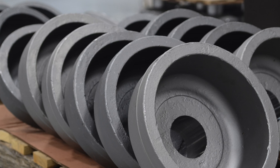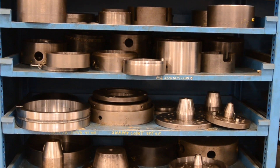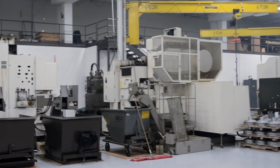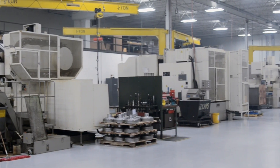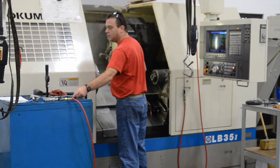It was very smooth. We were very pleased with the part. With Mastercam, we can seamlessly post between each machine. We can run the same part on the Integrax as a turning operation, or we can turn it on the two other large lathes that we have. All we do is change the post and run the part.